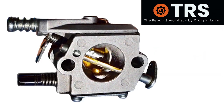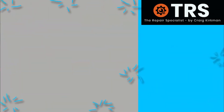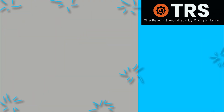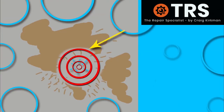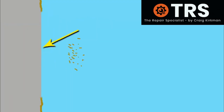When we put our item for cleaning inside the ultrasonic tank and turn it on, if we could see down to the microscopic level we'd see that these bubbles are being produced and imploding continuously throughout the whole time the ultrasonic cleaner is in use. This is happening in and all around the item that's being cleaned, so wherever the water can reach this is likely to be happening — which is why the ultrasonic cleaner is so good. The pressure wave created when the bubbles implode agitates and loosens the dirt and crud on the surface of the item being cleaned.